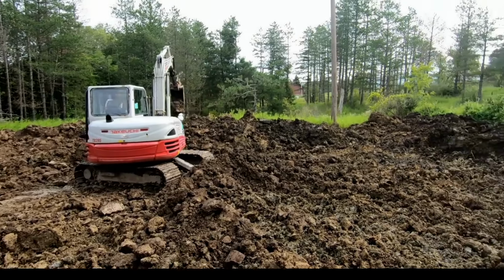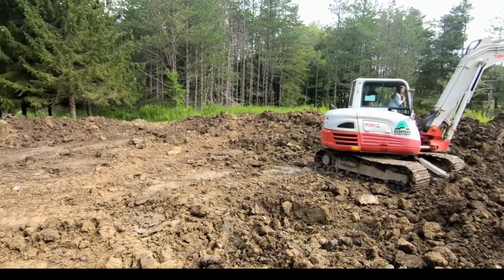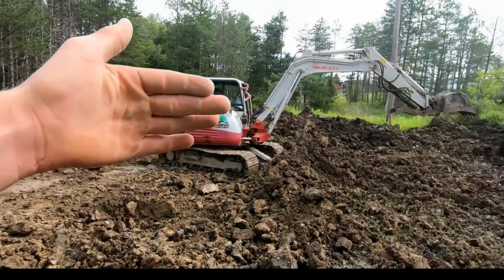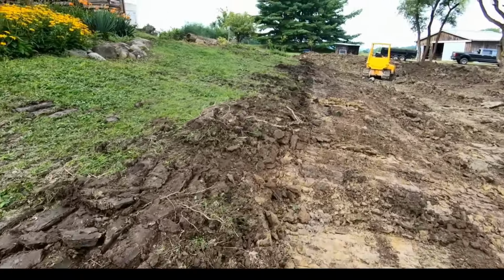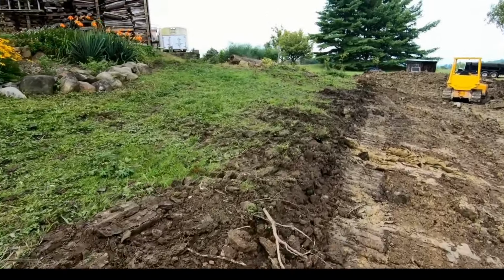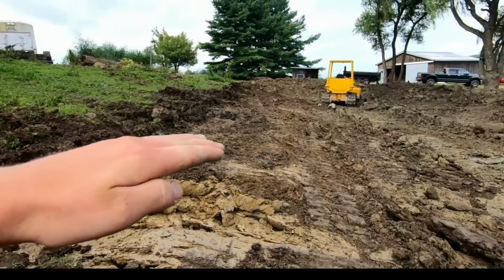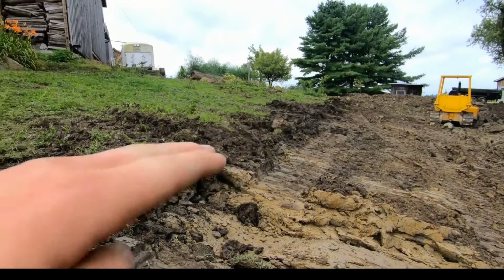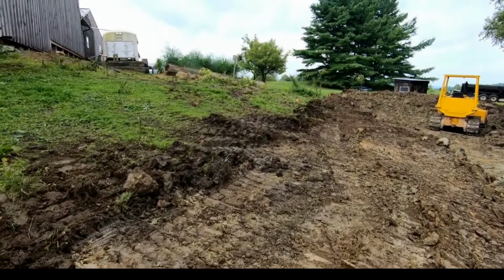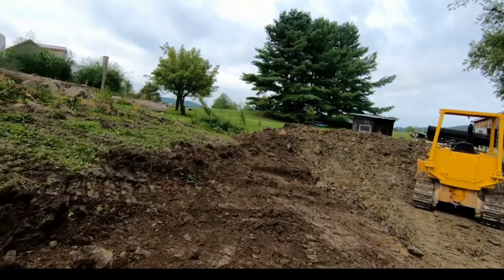We gotta be careful because right where that telephone pole is, there's a property line, so we have to stay away from that. So we're just building the dike from there, what that pile he's got there, this way. And then here's the edge that we're gonna kind of follow on this upper side. We won't need a dike here because this is about what the water level is gonna be all the way across. So we gotta bring that dike up to whatever we got formed here. We got some flags. So I'm gonna jump on the dozer and we'll get started on getting this dike formed.